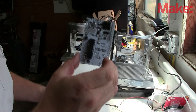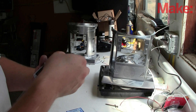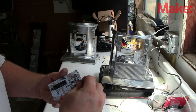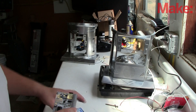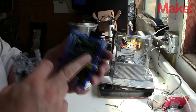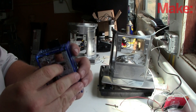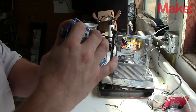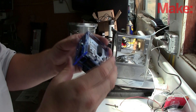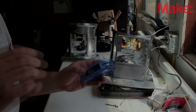One of the first things to do is to put the Alamode into the Raspberry Pi. First, you can place the microSD card into the Alamode — this will allow you to do some data logging or saving of actual program configs later. Then you find the double row header, that's the GPIO or general purpose IO, and the Alamode will actually plug right into the top of it. It all fits very snugly inside the Raspberry Pi case. That's how you install the Alamode onto the Pi.